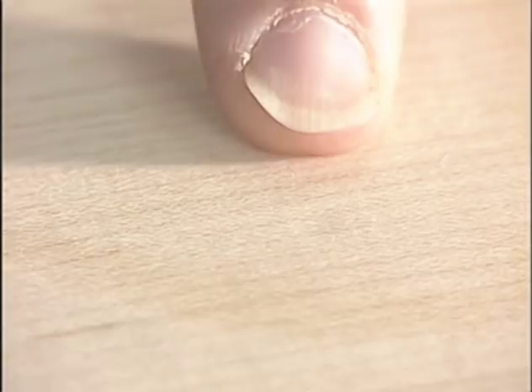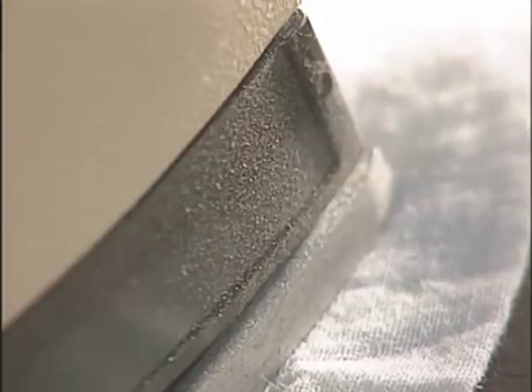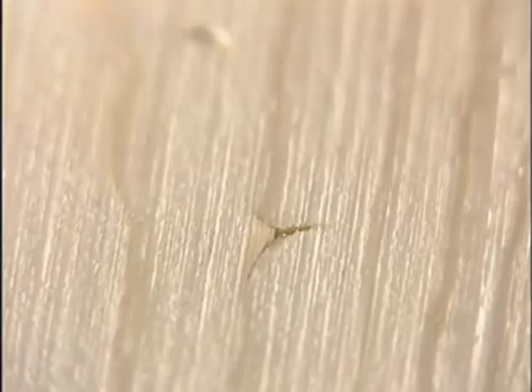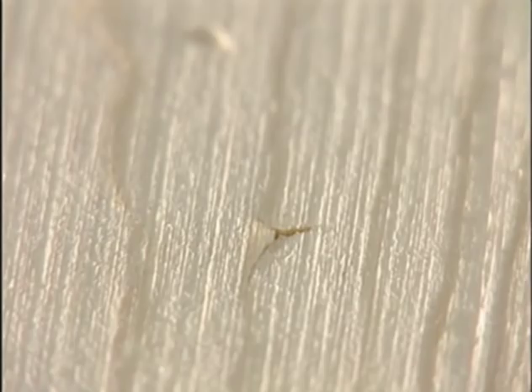Here's some Indian rosewood that I've dented. This is a heavy resinous tropical wood, and it's not going to respond very well to steam treatment. Not all woods will steam up, but it never hurts to try. Here's an angular divot that may be a dent, but probably has cut fibers. Let's try it anyway — same procedure, create steam with a hot iron over the spot. As you can see, the defect is still there, but steaming made it smaller. I'll still have to use some putty to complete the repair, but not as much. When you're not sure, try steaming first. You can always go back and putty later.